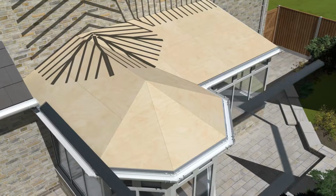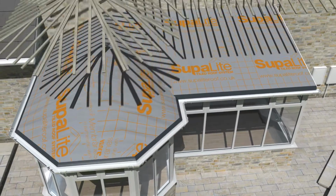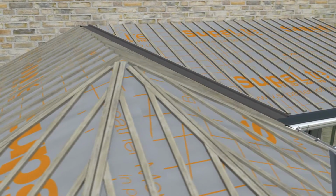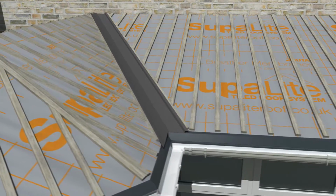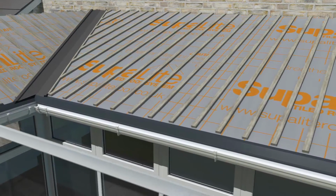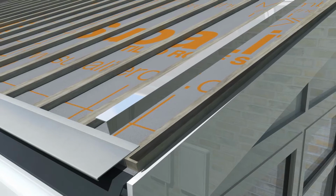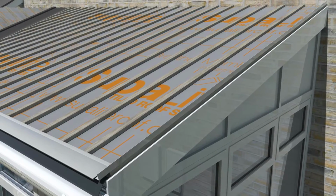The eaves and waterproof membrane are installed next, followed by vertical battens set at 250mm apart. Unlike other systems where the tiles are installed directly onto the plywood, these battens ensure constant airflow and eliminate any problems with condensation under the tiles. At this stage, the metal tile starter cleat is added. The barge soaker is attached directly to the battening using high-quality adhesive.